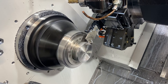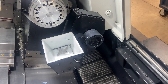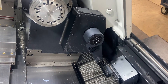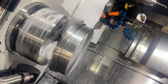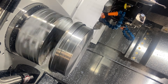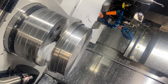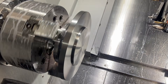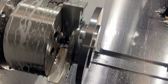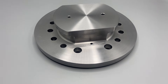This is heat-treated 4140 — we're making some ninja stars, just getting in trouble here playing around. But this machine is cool because you can also switch the chuck and really make big parts. This is a 10-inch diameter aerospace part that we're going to town on, trying to figure out how to make the chips and not be too stringy. It was a 2-op lathe part that also had a bunch of milling, and we had to make soft jaws for both sides. A part like this we're very proud of.